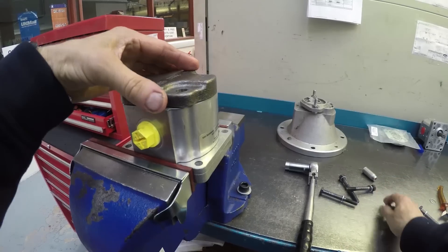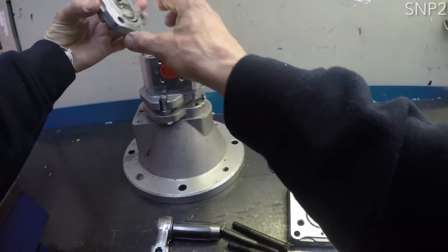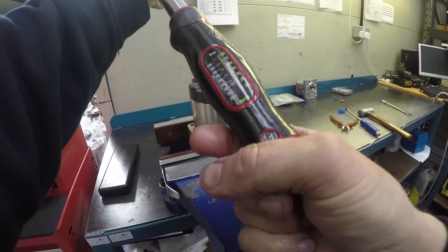Hold the pump together and grip the front cover in the vice. Slide off the rear cover, or if doweled, lift off carefully and check that all seals are correctly located. Replace the rear cover and torque bolts in a diagonal pattern to the manufacturer's value.